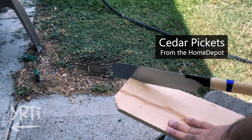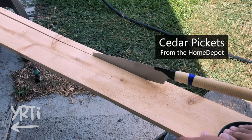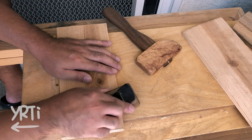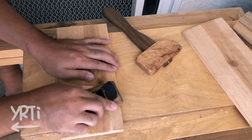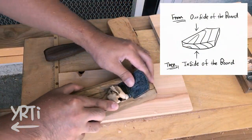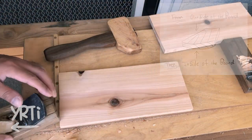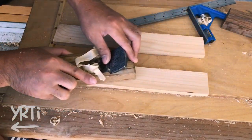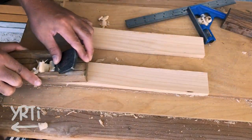This was the picket from Home Depot and it was super wet. I needed to dry it for a few days before starting this project. Then I did hand planing. For the bigger boards, I dimensioned the full size of the boards. As I mentioned in a past video, it's easier to flatten the boards from the outside first. But then I was lazy, so for the smaller boards I only made one corner square-ish, so I can kind of measure and mark and just smooth out the other two faces.